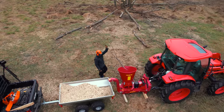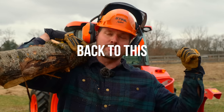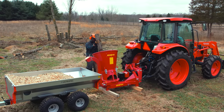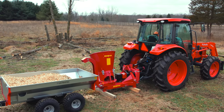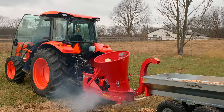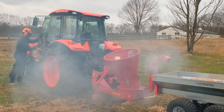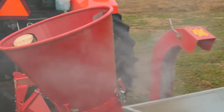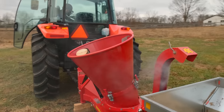We found the max of this machine today, and it's well above what it's rated for. The laser-engraved plate says three and a half inches; it's technically rated for four inches. We measured this piece at about five and a quarter inches — 25% more than what it says it can do — and it still handled it pretty well up until the driveline protection system kicked in. If I cut it into smaller sections as the manual says when you're near or beyond the max diameter, it would probably still take it fine. It's enough of a visual demonstration — it'll easily handle the four-inch rating. It was those belts smoking down there, which is pretty typical; I've seen that on a flail mower and even on little lawn mowers at home.